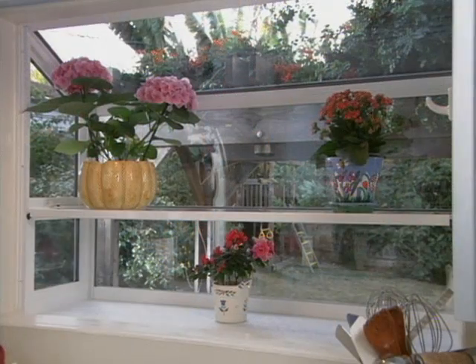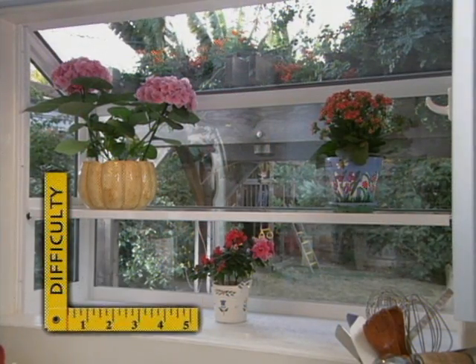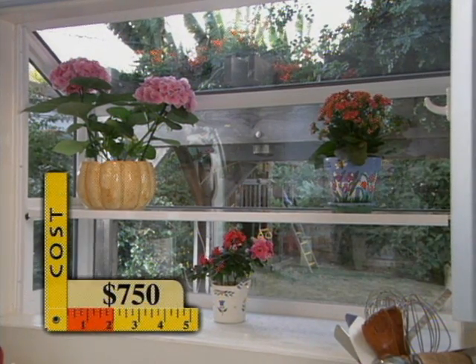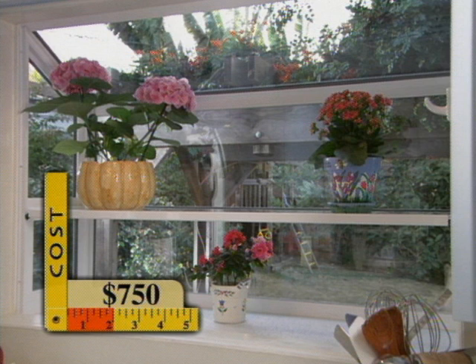On top of the paper we place strips of wood filler that will provide a nailing surface for the new trim. A final bead of caulk, four pieces of trim, and our garden window installation is complete. High-quality garden windows like this have dual-pane glass for good insulation from cold and heat. They let you have flowers and herbs literally at arm's length, provide ample natural light, and make any room feel larger.